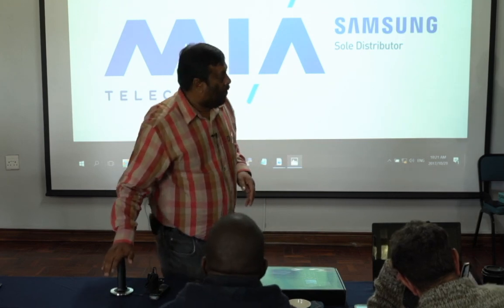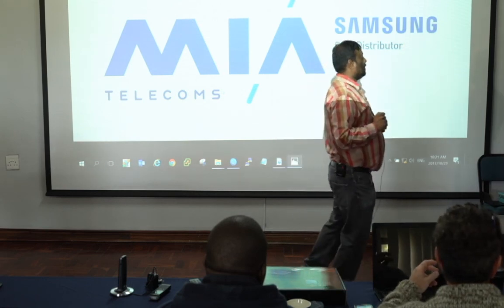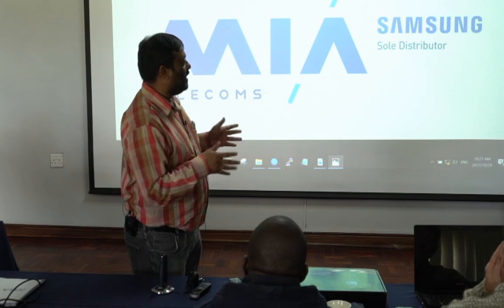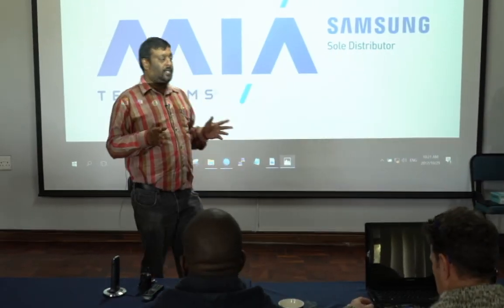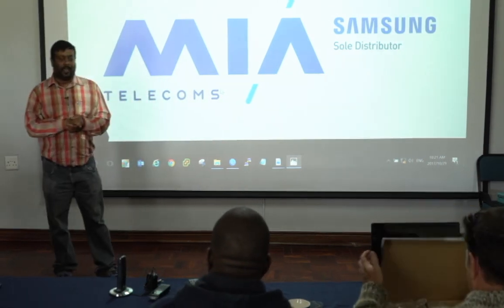Okay, for the demonstration of setting this up today, we are going to connect it to an on-site PABX. For today's purposes, we're going to connect it to our 7070 that's on the board there. We're going to show you how quick, easy, and simple this thing works. The single cell takes two repeaters on it. Remember, you cannot exceed, not two. Is it three repeaters? Sorry, takes three repeaters on it. Okay, you cannot exceed that. You cannot put another base station on. It will take up to 20 handsets as well.